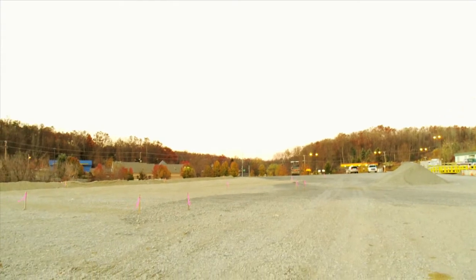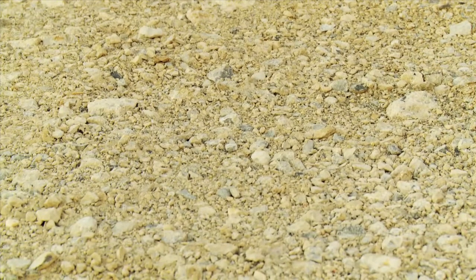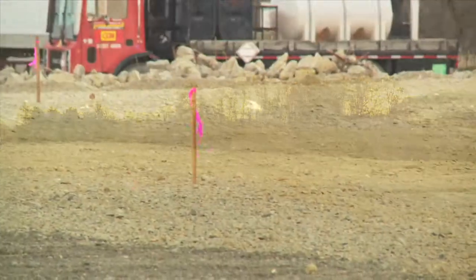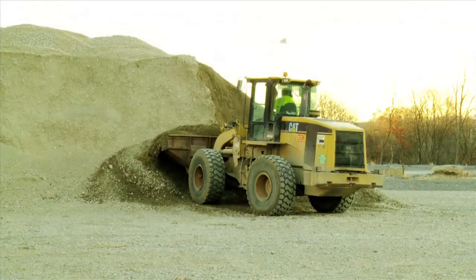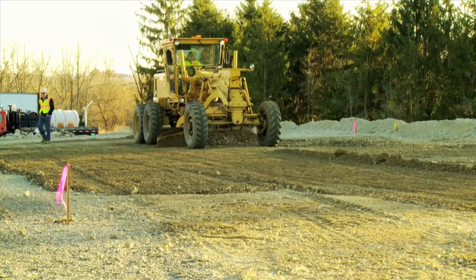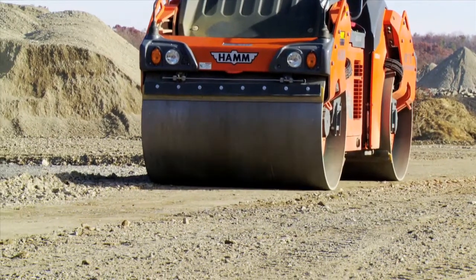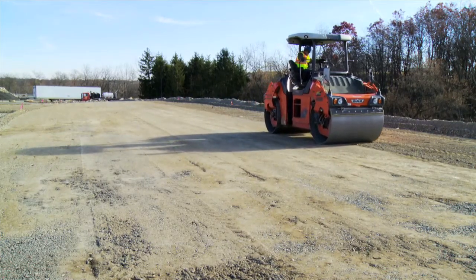The placement process for roller compacted concrete begins with the sub-base preparation. In this example, the original surface was clean aggregate and earthen fill. The desired end result was a flat pad with a slight slope for drainage. Grade stakes were set accordingly. Recycled crushed concrete was imported to create the sub-base. This material was spread and graded. When the correct grade was achieved, the material was rolled to compact and smooth the surface. No further preparation was necessary. This process could be varied somewhat based on the conditions of the site to be paved.